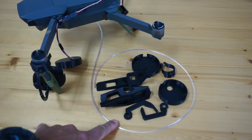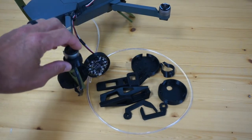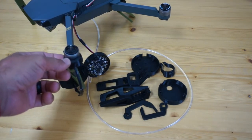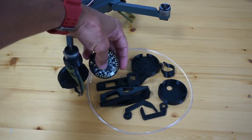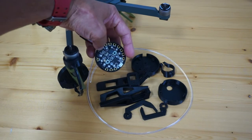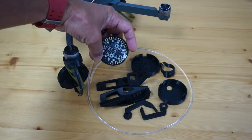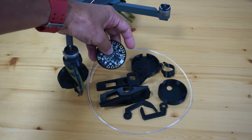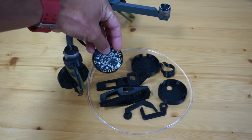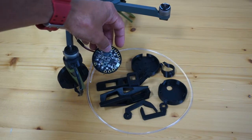What I want to do now is demonstrate how this works. It's actually really creative. When the LEDs are toggled — turned on and off from your Mavic Pro — that light is sent through this cable to a little phototransistor on the Circuit Playground Express board. There is code running on this board in a block or scratch-based programming environment. The code is available at the Adafruit link and it's very basic.